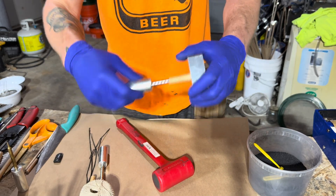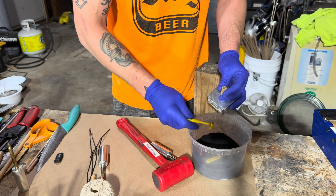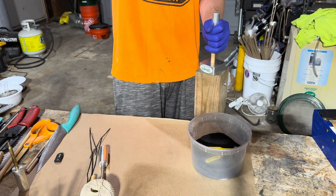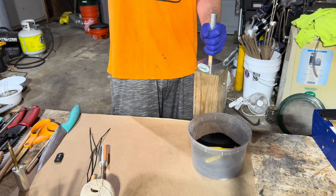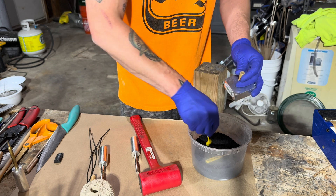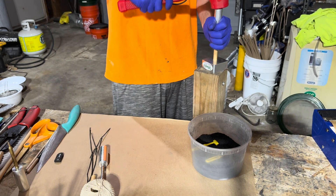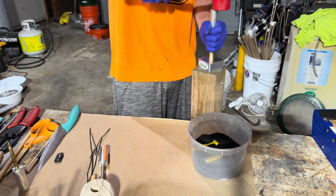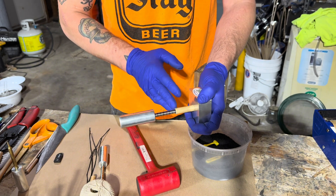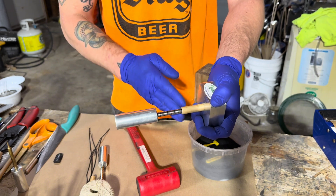So we're just over a quarter inch there, so I'm going to back off my scoop just a hair. It's important not to over ram each increment or it's not going to burn right. That's ten whacks, and that was a perfect increment size. Just so we're following along, we started with a two inch tube. I have my rammer marked with a red line every inch. That's three increments — quarter inch, half inch, three quarters of an inch. So we're right on track where we wanted to be.